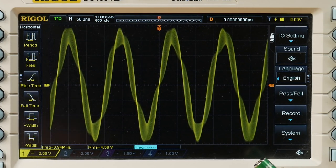We'll end up with several versions of the noise superimposed on top of each other. So if we want to use the A to D board to capture any real RF signal, we're also going to need some kind of filter to make sure we reject any range of the RF spectrum that we don't want. Otherwise, it's all just going to get superimposed on top of the signal that we care about, which would be a problem.